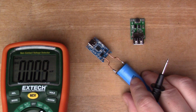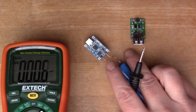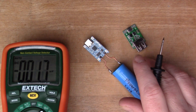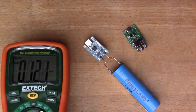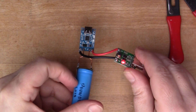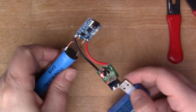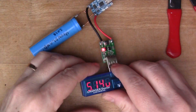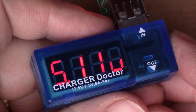Next I'm going to run a couple of wires through to the buck converter and put the meter on it to see how much voltage is coming out of the output port. The leads are on the buck converter now, so we're all fully connected up. Let me turn this little meter on the port the right way around — there we go, 5.1 volts.